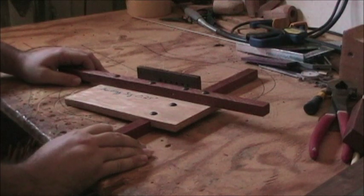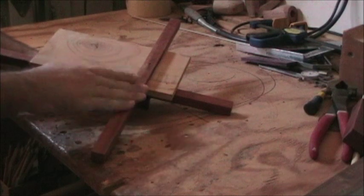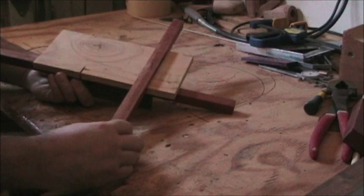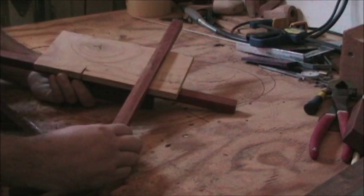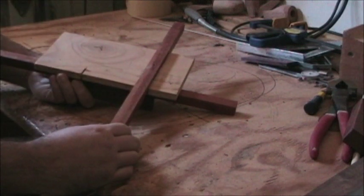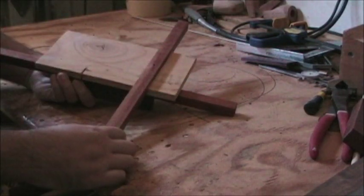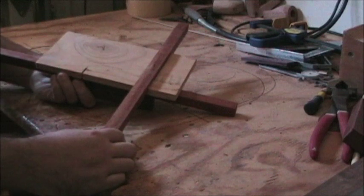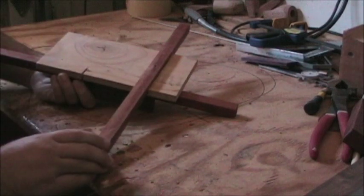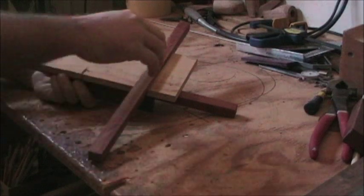Here is the kerfing jig in a little bit more of a close up. The main piece used here is the one down here — this is the slider. This piece has to be cut to the same width that the notch in your bandsaw is for the miter attachment. You are going to put a piece in there and keep trimming it until it is just wide enough that it doesn't wiggle from side to side, but it still slides through fairly freely. Most miters actually wiggle a lot more than this thing should, so make this piece first.